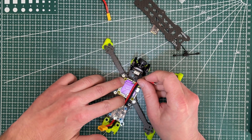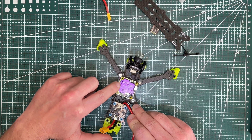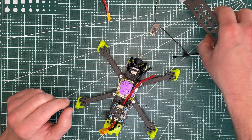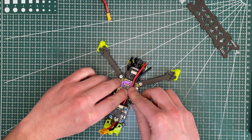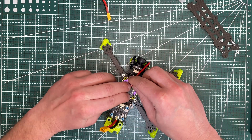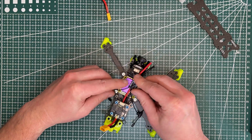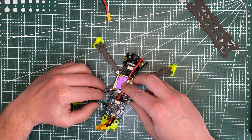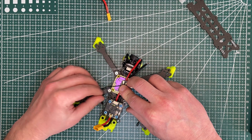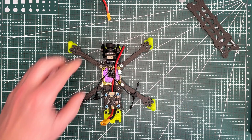There's enough space for the capacitor and also enough space for the wires. I'll probably have to solder this motor first, but my pads for ports and everything else remain open — so I'll try this approach. In terms of the receiver, I think I can just put it in a zip tie ring and put it on top of the wires. I'm not going to put the antennas in the back — I'll put the antennas on the arms. Okay, that sounds like a plan, let's stick to this and see what we can do.